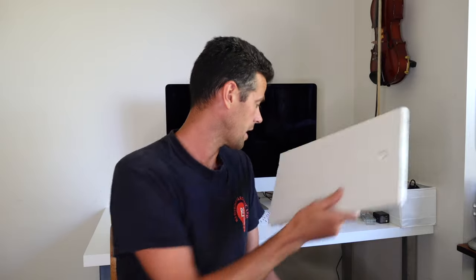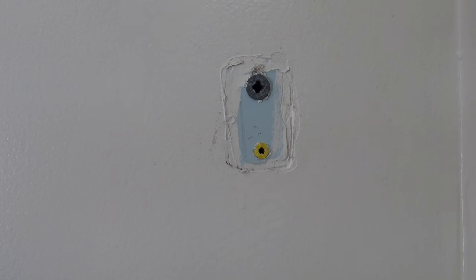I've been using these for a long time and I've never had one fail. For something like a towel bar where somebody's gonna be pulling on it, these are gonna work really well — way better than those twist-in or little plastic drywall anchors that don't do anything. Those just get put in long enough for the house to get sold, so you come in after you buy it and pull it out of the wall. Anywhere that you can't get into solid wood, use toggle bolts.